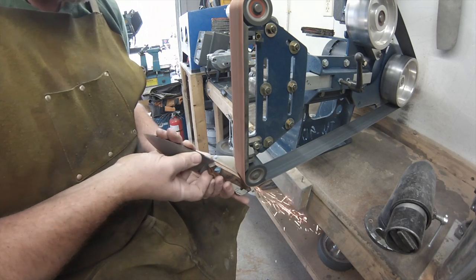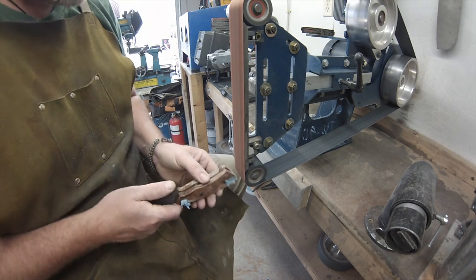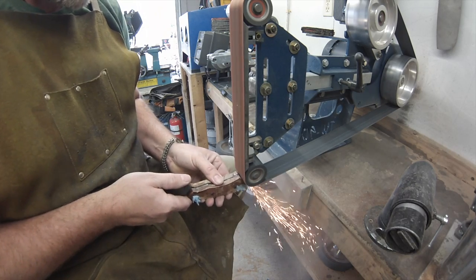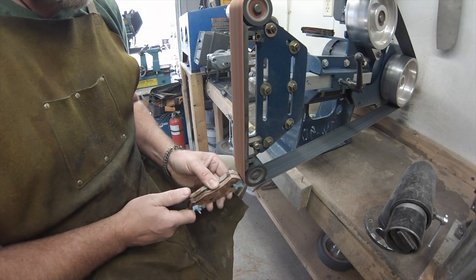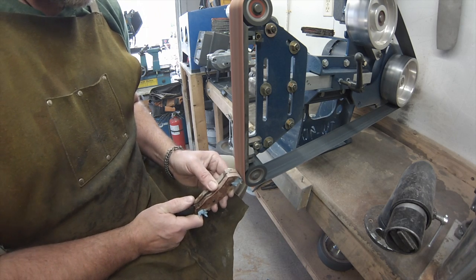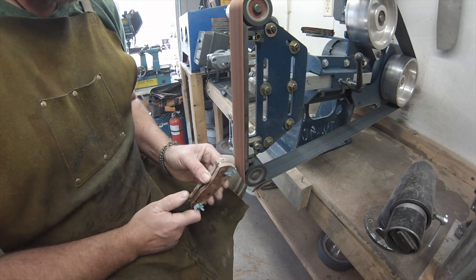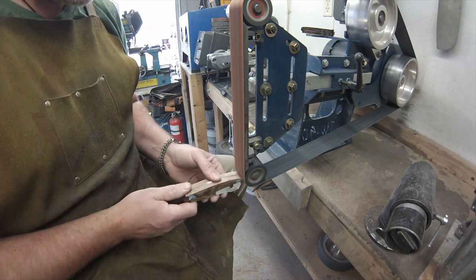You have to be careful when you're using the wheel on the spine — it should not have any divots in it. If you're on a contact wheel and you stop for even a short period of time, you'll end up getting little valleys in your spine, which you don't want. But we can clean that up a little later even if it gets some — just working around that profile.